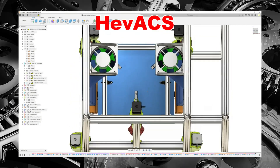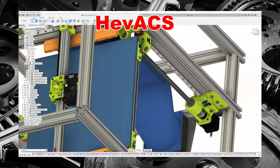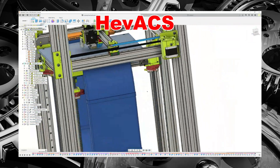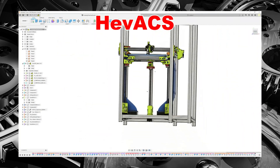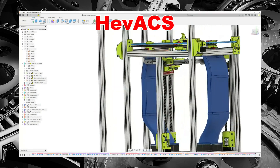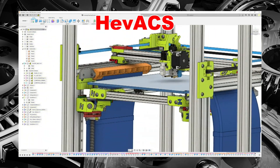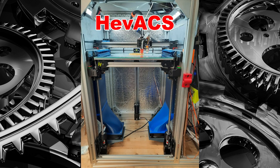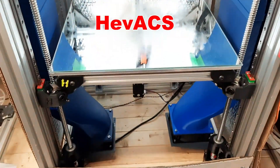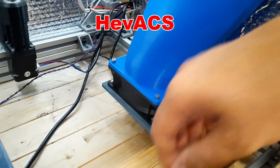Finally, the third system to be tested is based on a pure brain fart from my end. Made from two big powerful fans, this system takes cold air from the printer's bottom and brings it up to the print zone via two side ducts. I made sure that the surface area of the output was large enough so the fan would keep up with the increase in static pressure. The airflow is parallel to the bed surface and, once PI-tuned properly, it will have limited to no impact on bed or nozzle temperature stability. The print head of the Evort moves fast, so the amount of time spent on the same spot can be quite short. The goal for this system is to improve the cooling of a freshly laid layer while the printer's head is busy somewhere else. The total airflow provided by the two fans is close to 300 CFM. Will that be cooling enough — or too much?